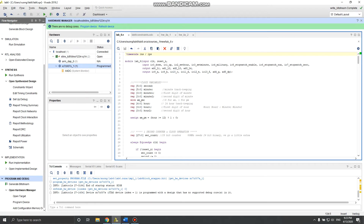Now I'll talk about the code. The device is running. I have two inputs here — clock and reset — and then eight inputs which I've labeled: IO1 is down, then up, set hour, set minute, military time, stopwatch enable, and so on, as I demonstrated in the demo.